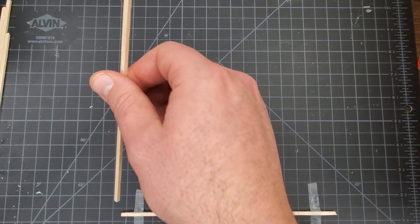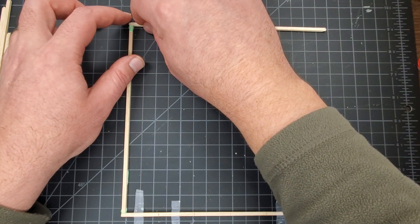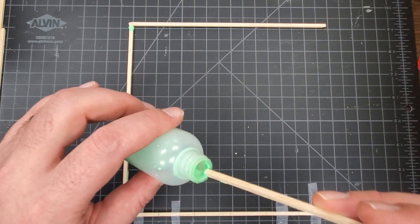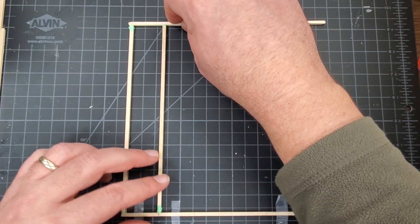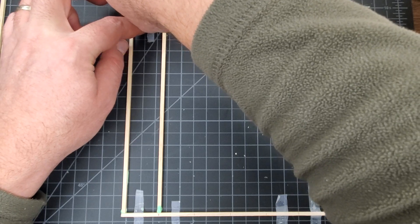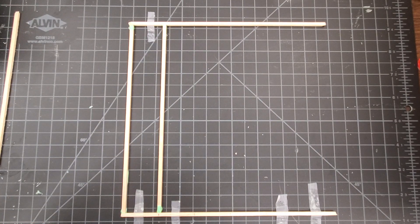Now I'm going to place that on my bottom plate and also put the top plate on as well. We're just going to keep going down the line — dipping pieces in, trying to get off all the excess, just having glue on the tips and ends. Clean up any glue that gets on anything else. Once we get our first two studs down, just like in the previous video, we're going to tape that top stud down so it's held in place, then keep going.